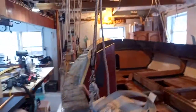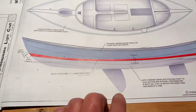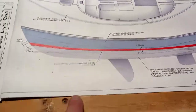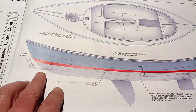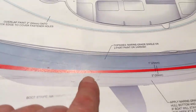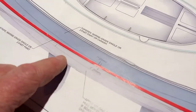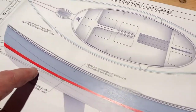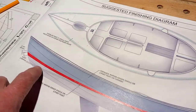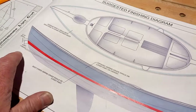Now that it's up in the air, I have to decide where I'm actually going to put the waterline. Looking at the drawing, I made a line running off the bottom of the page — assuming that's a reasonably straight line per the boat design — and then a parallel line up here that runs right below the waterline as shown in the drawing. The waterline should end up somewhere along this line, and in the drawing they've given it a little extra rocker, a curve, to make it look more interesting.